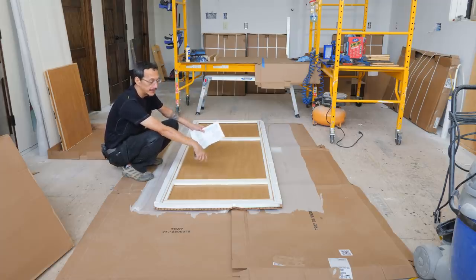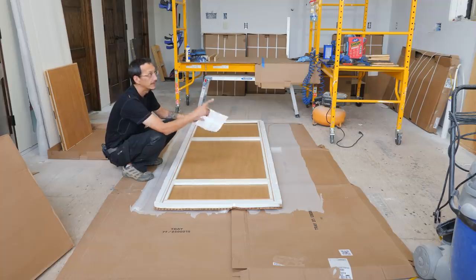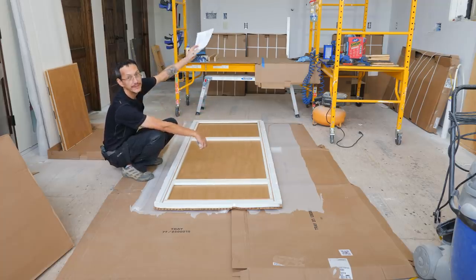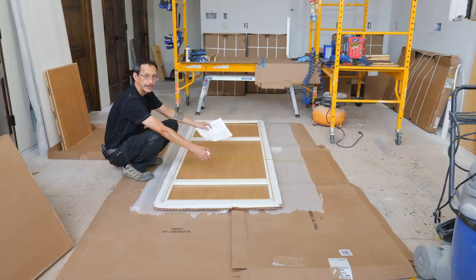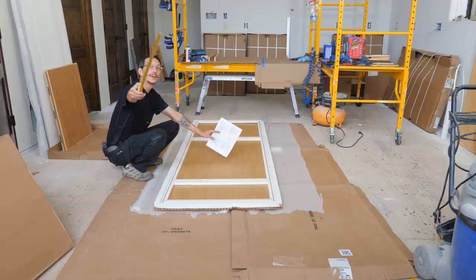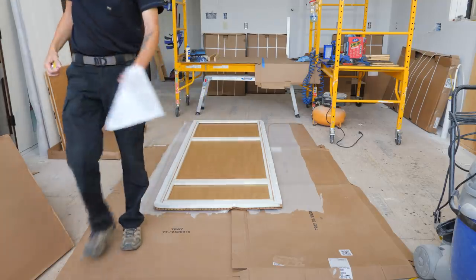The other thing, typically, or in a lot of situations, a cabinet this tall, you're going to want to assemble with a couple people vertically, standing up, because once you assemble it, you can't tilt it up without it hitting the ceiling. Now, they do make an option where you can have a separate toe kick box, so you could tilt it up and then lift it up and set it onto the toe kick box. We didn't do that because we didn't have to, because I can just build this and move it out there where that big cathedral ceiling is, stand it up, and slide it in here. So that is what we're going to do.